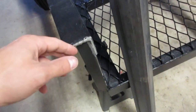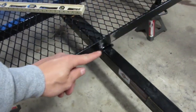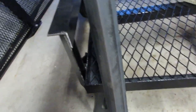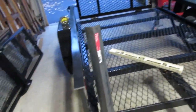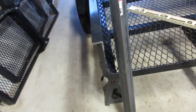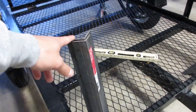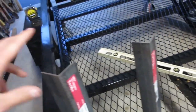These parts that we're going to extend out seven inches are two-inch angle iron, and the supports are going to be inch-and-a-half, kind of at an angle going in. I'm actually going to add extra support — just had one in the center but I'm going to add ones on the ends too. Once we get the front rim all tacked up, let's start chopping: seven inches of two-inch angle iron for each side.